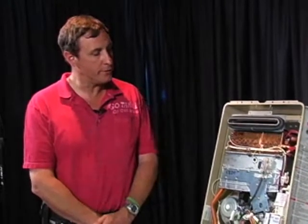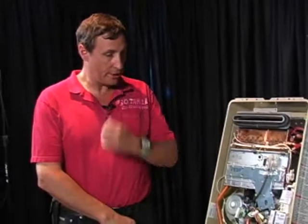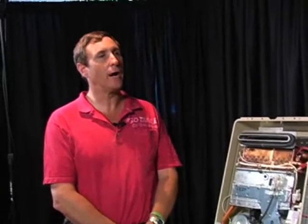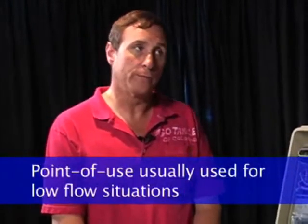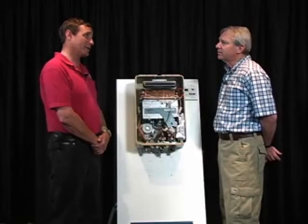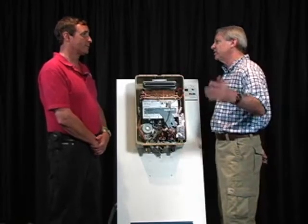And as far as point-of-use units, the only point-of-use units that are available in the United States are electric units. So we're kind of back to that same problem. What we really see for point-of-use are very low flow ones that can make a cup of tea, for example. You get 120 or 130 degree water coming out, but it's a tiny amount. You might usually see those in a kitchen, just serving the kitchen sink and maybe the dishwasher. Exactly. You go to Europe and Asia and places across the puddle, and you do see gas point-of-use water heaters, but they are illegal here. There's no way to put them in.